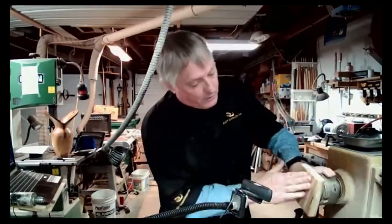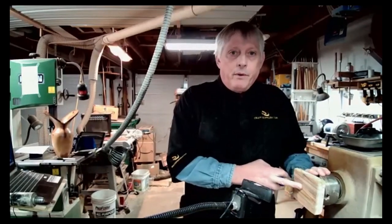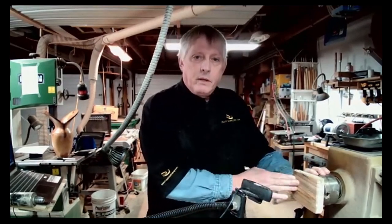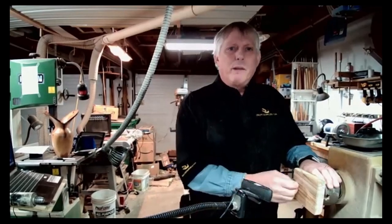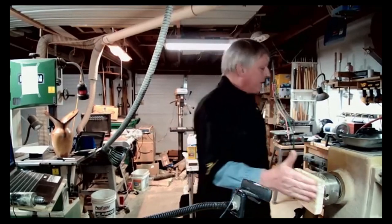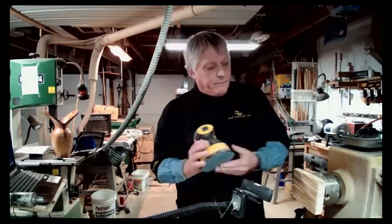And so this was sanded to 320. Now at this point, I'm going to bring this to 400. What I would do, typically, I would back up to 320 again. Sometimes I might even back up to 220, depending on how things look, how it's set up, how many really punky areas I had. I might want to back up a little bit and try to smooth out those punky areas. But on this one, it's pretty dry, so I'm going to just quickly sand this to 400.